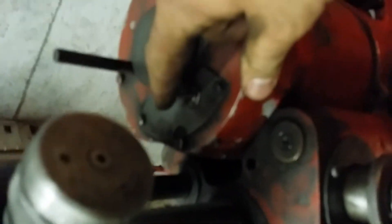Usually I watch the chips at the bottom of the bore and when they start moving I'll disengage it with that lever right there. Sometimes you'll hear it altogether stop because there is no webbing on some of the front cylinders. I just disengaged the cutter right there, so it's essentially in neutral on the feed. Once you disengage this, reach up and flip the power switch off.